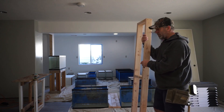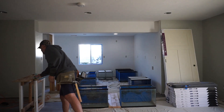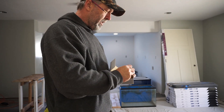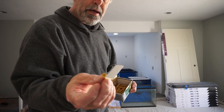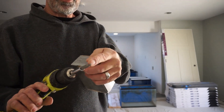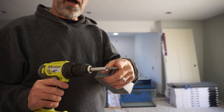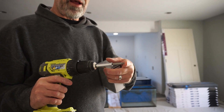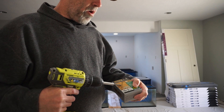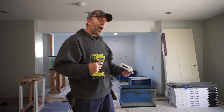I really love the deck screws. I don't use Phillips screws — with deck screws you get better shear strength. I use a 10 by 2.5. They have this star bit driving bit on them. It drives a lot easier and you don't get any slippage. With Phillips screws you tend to slip after a while because they start to wear down. These things are designed to hold people on decks, so if they're going to do that, you're gonna see I over-engineer these things.